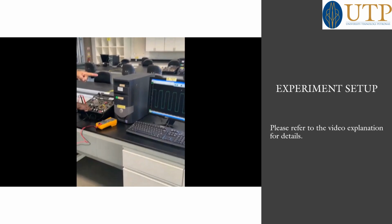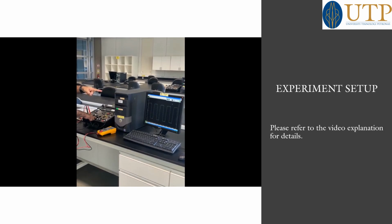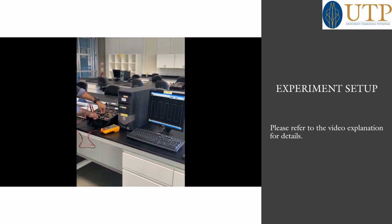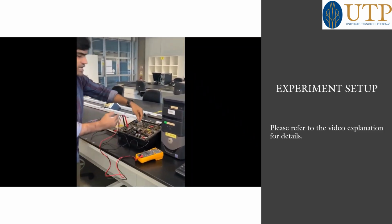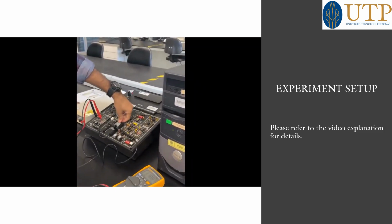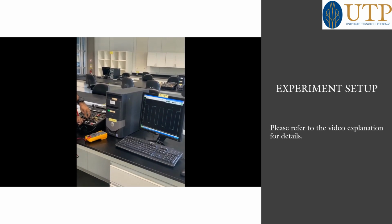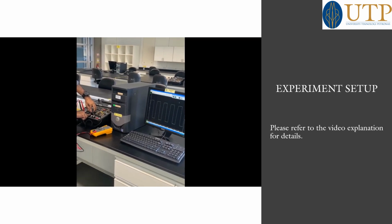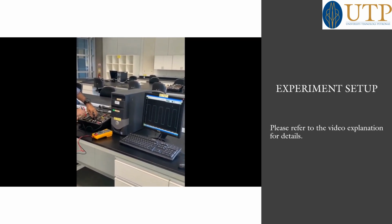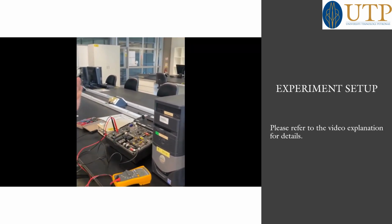If you watch your screen, when I move upward, you see the distance will increase. If you increase the distance, the capacitance distance automatically increases, meaning it expands. Now as I bring the plate back and reduce the distance, check the screen. As I decrease the distance, you see the capacitance distance also decreases. This is the function of this capacitance sensor.